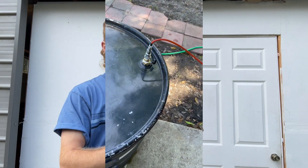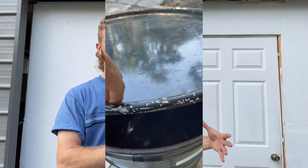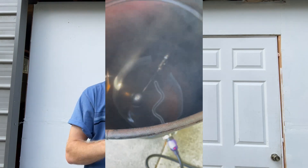I have a separate boiler and steam tank for a variety of reasons. The first reason: it's more safe. When I built a few prototypes with the heating element, boiler, and steam tank as the same unit — like a Bubba's Barrels kind of situation — I had issues where I would be melting the bags at the bottom, or it could be more hazardous. So I decided to separate the two units, and that's worked really well for me. But of course, do what works for you — I'm not saying that design isn't good.